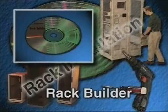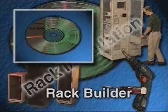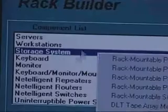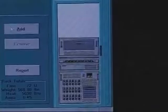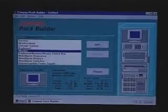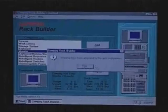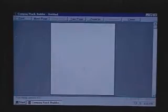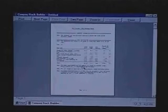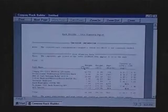Here's a demonstration of adding components using Rack Builder. Rack Builder can assist you with the best configuration of your unique set of hardware requirements. This software generates a report listing all Compaq parts and part numbers and the order that your components should be installed. Generate this report prior to the installation of your components as a guide to help plan your rack configuration